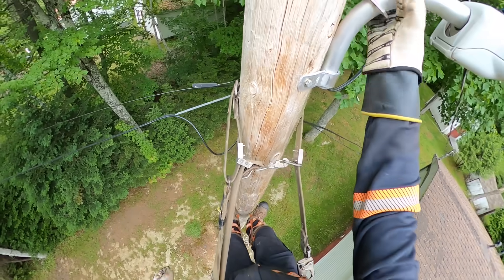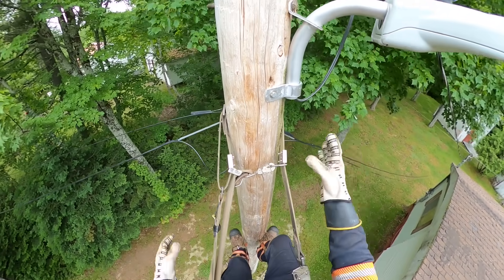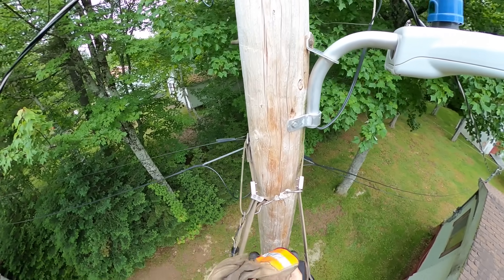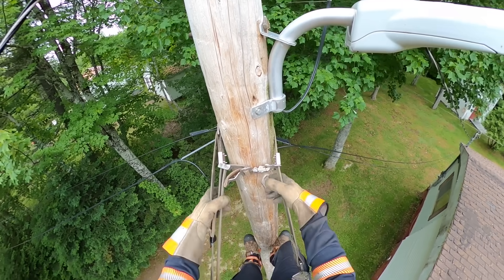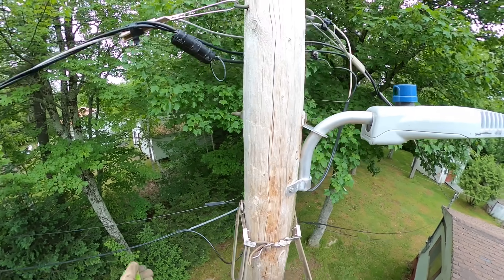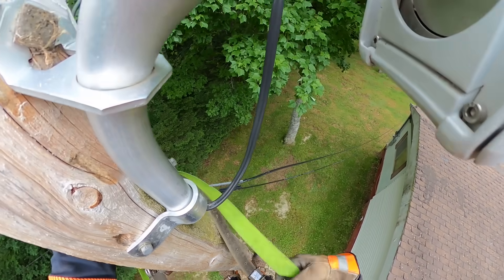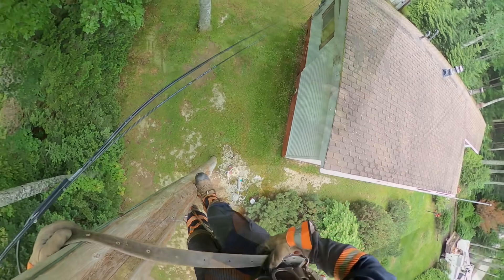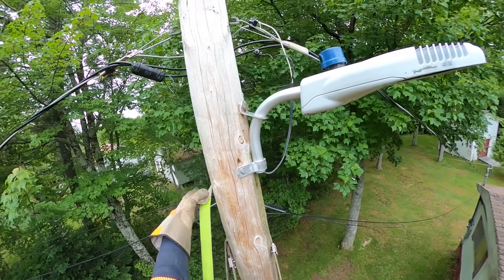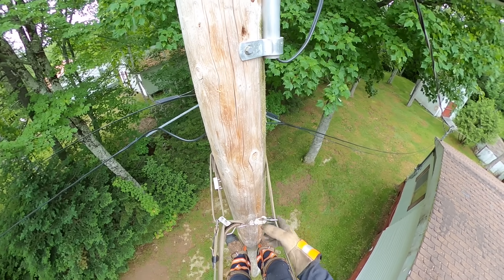All right, down we go. When you're crossing back down below an obstacle, you want to get to your lowest position possible — you don't want to be starting up high. We're going to climb down low, our belt's grabbed. We're not going to need these 1kV gloves anymore. Make sure you don't transfer your weight down below the obstacle — we're going to keep our retractable up above the obstacle, unbelt our cross strap, take our weight off — there's no weight on either strap right now. Then hook our cross strap below.